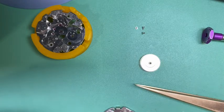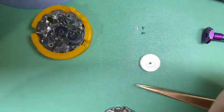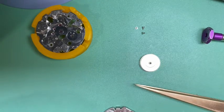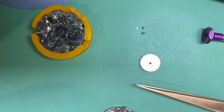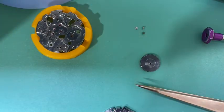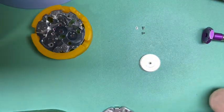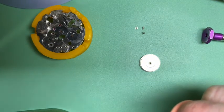And dealing with any issues there. So, because once everything's lubricated, once everything's in place, we don't want to have the thing binding. And we're like, oh, it's binding. What's wrong? And the issue is the barrel, and the barrel's binding, and that's why we're having a lot of... Wouldn't have an amplitude loss, but you know, the watch isn't winding properly, it's not working efficiently. That could certainly be a reason that would be the case.